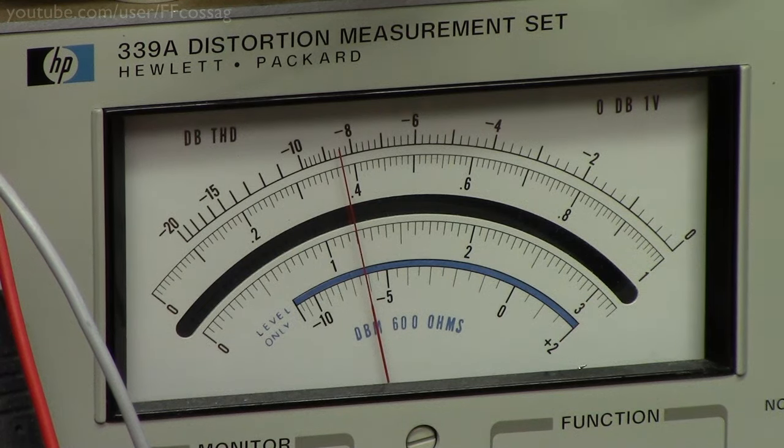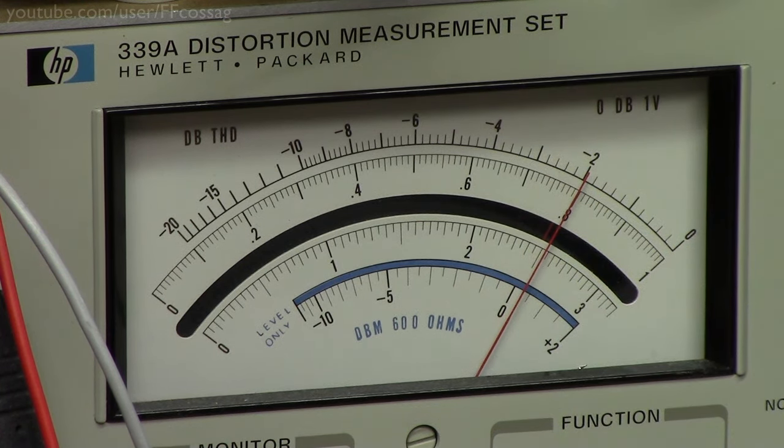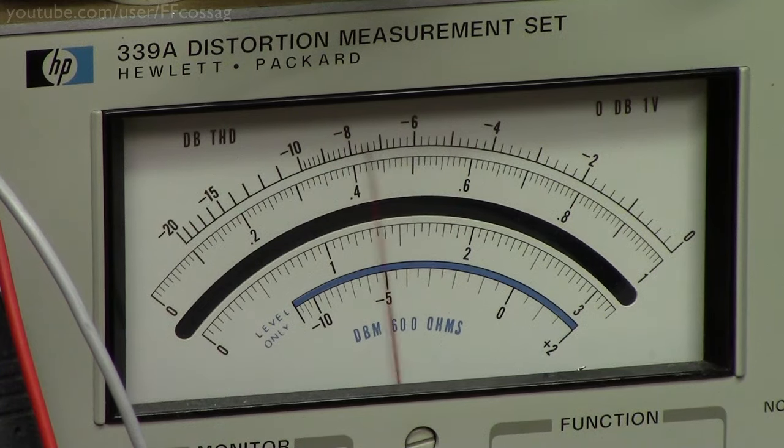Right, we're at 80 Hz right now, we're rolled off quite steeply. So this will give us a response if we meter 70 Hz, 60, 50, 40, 30. So we've got a reference level about at 30 Hz at minus 2. It starts to roll off about a decibel at 20 Hz, and at 10 Hz we're just gone again. But really we've got 30 Hz 0 dB, 40 Hz minus 1, 50 Hz minus 2-ish, 60 Hz minus 4, 70 Hz minus 5, 80 Hz minus 6, 7, and 90 Hz we're approaching minus 10 or something.